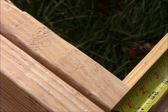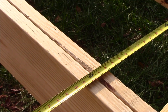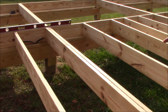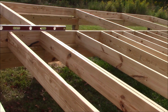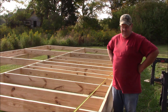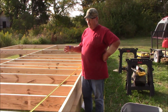I've got double joists every eight feet. Because I have a trailer that's eight feet long, I can't carry boards longer than eight feet, so I can butt these together and it just adds stability. A two-by-eight floor joist will span ten feet one inch according to engineers — you can use that span for up to ten feet one inch. What I'm spanning is about 86 to 88 inches, so these two-by-eights are going to be more than sufficient.